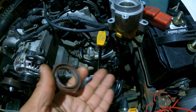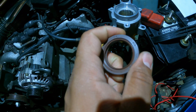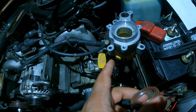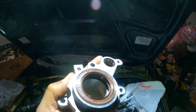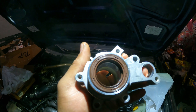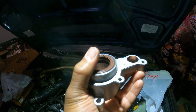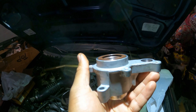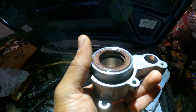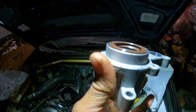I'm going to lightly lubricate the entire circumference of the seal with oil and lightly lube the inside of the housing with oil as well. Here is the piece with the seal installed. I took a small rubber mallet and hit it all around evenly — you could also put a flat piece of wood on top and hit it in the center so it all goes in flush. I oiled the seal and the inside of the part first before doing so.